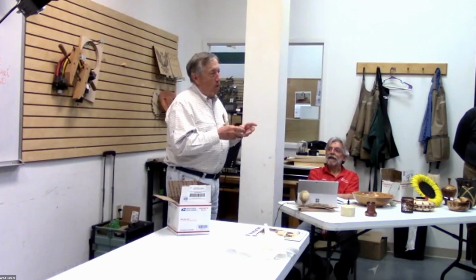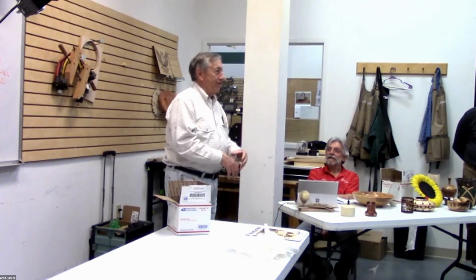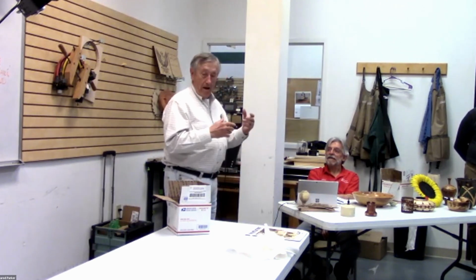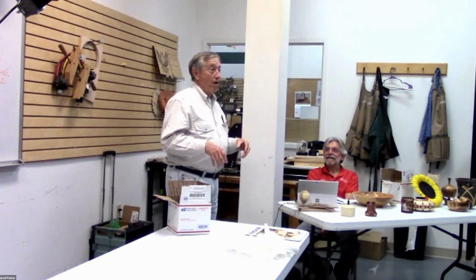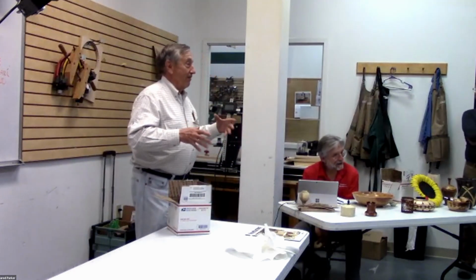Barbara, did you dry a block of wood and then turn it? No, I turned it and then dried it. What's the difference between drying it with the desiccant or in the microwave, which is my favorite way? I don't know, but with the microwave, I always manage to get it cracked, and it gets hot or warm. My wife gave me a Kick Saver, and I poured the desiccant in, put the bowl in, filled it up with desiccant, sealed it up, let it go for 3 days and came back with 93 grams less, 18.81% to be precise. It was amazing. After I dried it, sitting in the shop it just took on water from the shop. The fact you can reuse this stuff is pretty cool because it's not cheap, but I got 3 gallons of it and only needed 1.5 gallons.